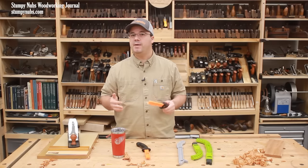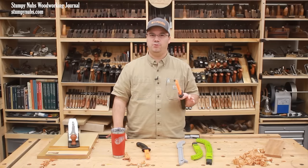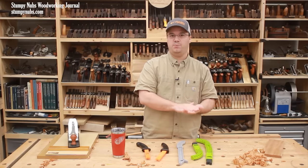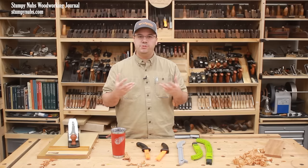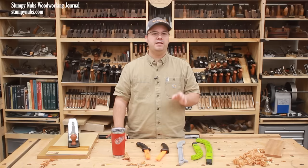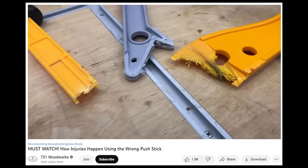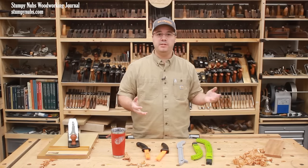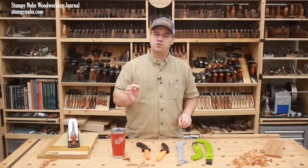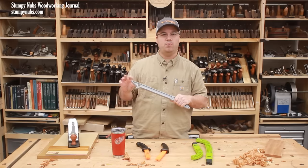Many of you may conclude that the 731 video is saying you should avoid plastic push sticks altogether, but that's not necessarily true. Reputable manufacturers that specialize in woodworking products choose their materials specifically so they can be cut without shattering. A few online retailers do state somewhere in the description that their product is shatter resistant, so you should look for that. If they don't, you can sometimes read reviews for experiences of those who've used the product to see if people are having these things explode on them. As for wooden push sticks — a scrap of wood can be transformed into a safety device for little more than some spare time, and that is a great option, as long as you use sturdy material, preferably with grain that runs end to end so it won't snap in half along a weak grain while you're using it.